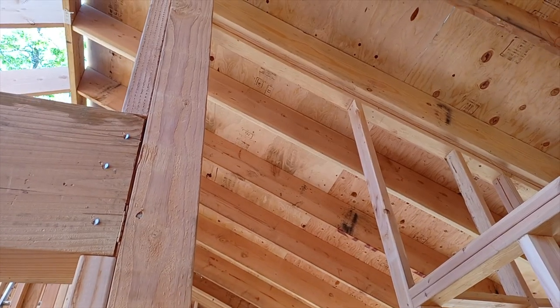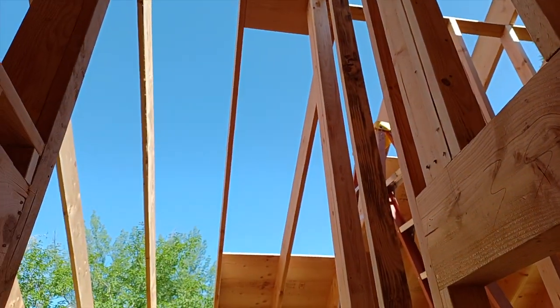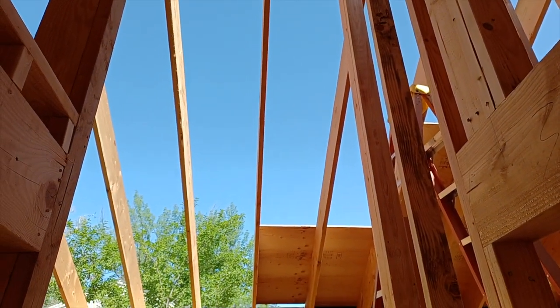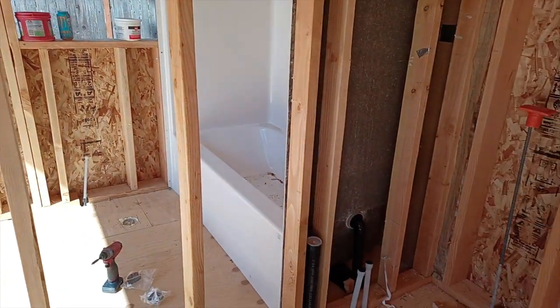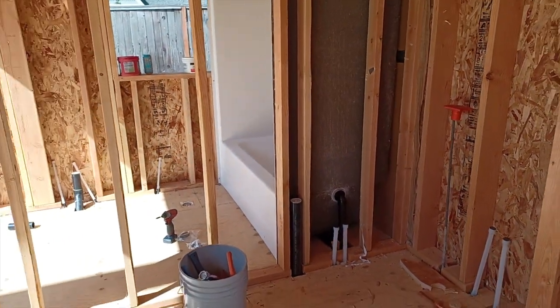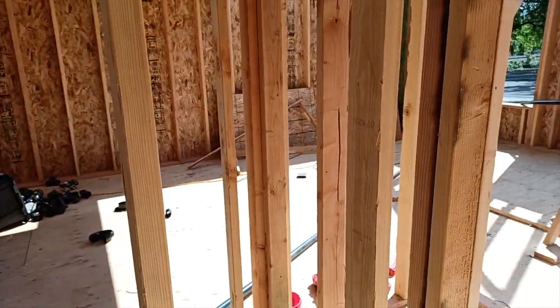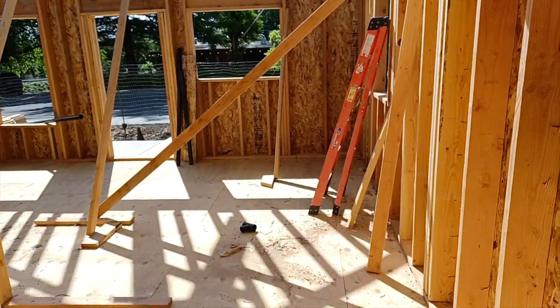This side of the roof is sheeted and next we're going to be moving over to this side, covering up this big skylight. Andy is in here doing rough plumbing — he just mounted this fiberglass tub-shower combo. We've got our underfloor plumbing coming up and getting connected to our drains. It's a pretty simple detail on this one — all the plumbing is on one wall.